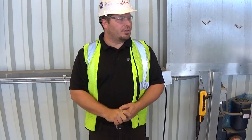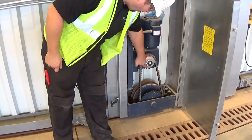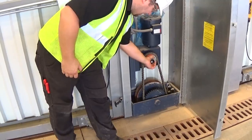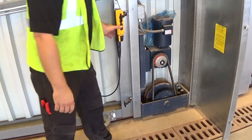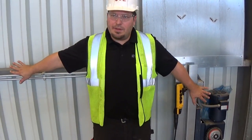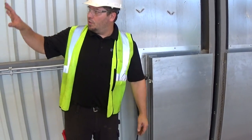Any questions on emergency operation? You don't want to remove that nut — you just loosen it up. These aren't big washers; those are convex clutch springs. When these two silver plates are loose, at that point the door is free rolling. When you tighten this back down, they're not loose — I can't move these around. If you loosen this and hit drive on the door, the center would spin but the chain would not — it basically puts it in neutral. And that's per panel. There are two drive systems on this panel, and you'd have to do the same thing on the other panel to push that door. You could also loosen the clutches on the outside drive doors and push them. You don't want to push them with the clutches tight — it causes problems.